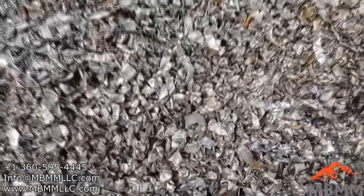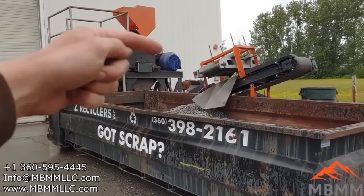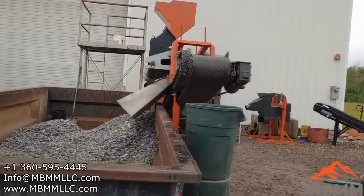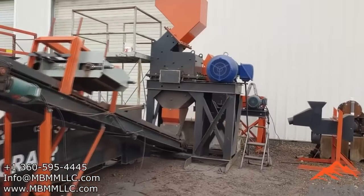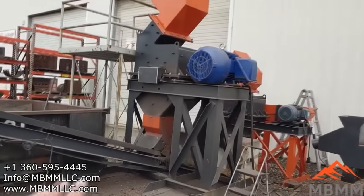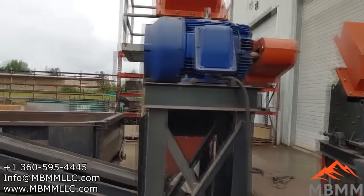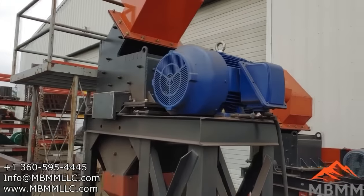And here's the machine. That's a 100 horsepower motor wired at 480 volts, and it draws about 120 amps at max load. I was feeding that thing, we have a little amp meter that I was watching, and at idle, when it's just turning the rotor, it pulls about 45 amps. And then when you throw in a stator, it'll jump up to 100 or 110.